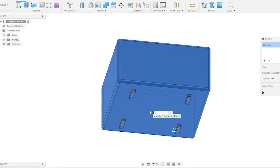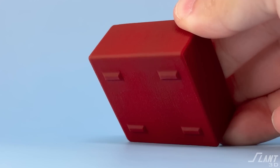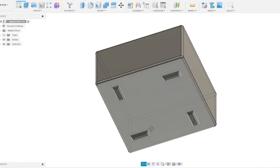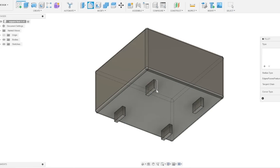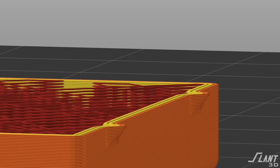That's the most basic version of the feet. Now not all feet are round — sometimes you want them square. You might design the feet so that they actually control the part in certain directions; you might want it to slide in one direction but not side to side. You can do these through a circular pattern on the bottom, but again make sure you're chamfering them all of the time. If you have flat, tab-like feet and you want to make them long, make sure that you're rounding them off as much as possible to ensure they do not create an overhang anywhere.